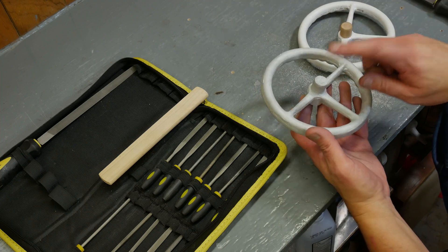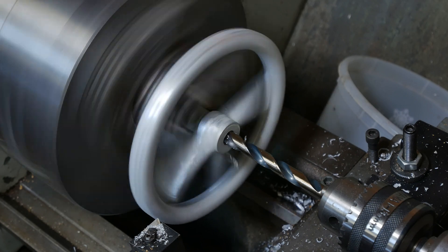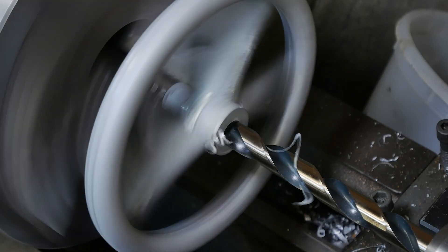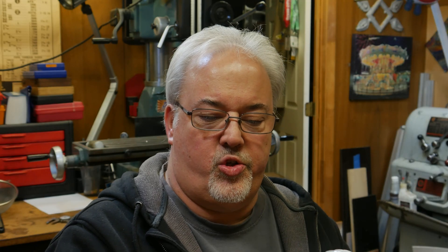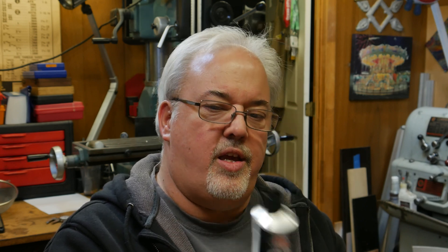I've got a few little imperfections here that I think we can fill with some JB Weld. Here's the original with the wood plug and our copy with a metal plug that still needs to be cut out and drilled through. I'm going to use the JB Weld as if it were body filler — my reason is that JB Weld will hold up to powder coating, so the heat involved won't affect it. It's sandable and fileable, just like body filler.